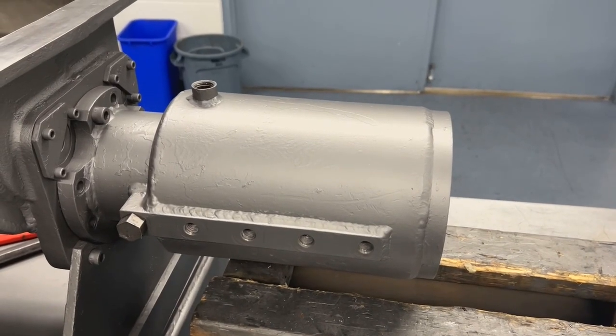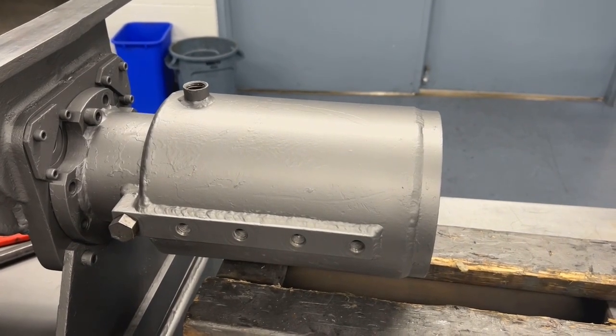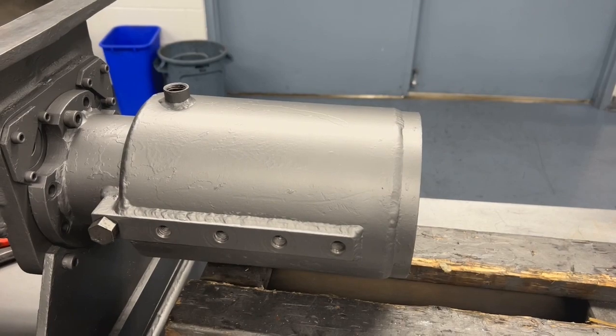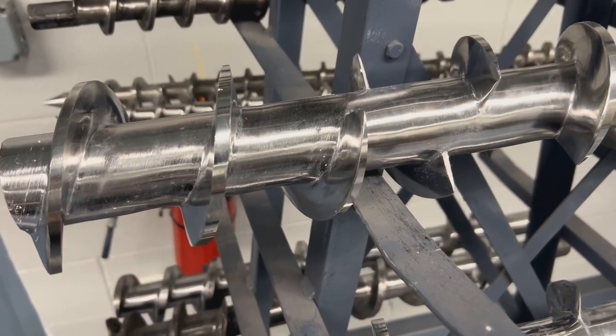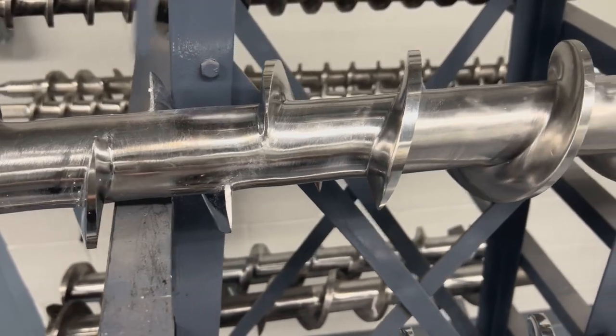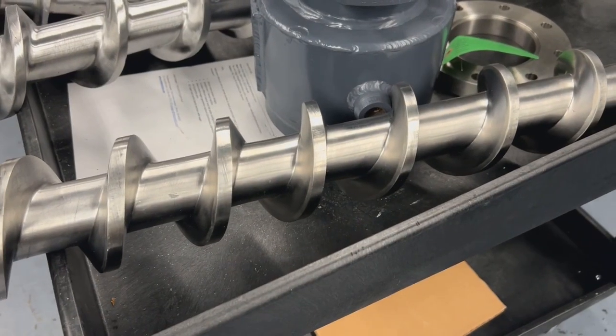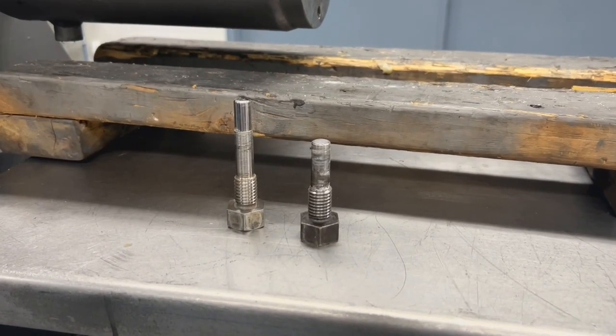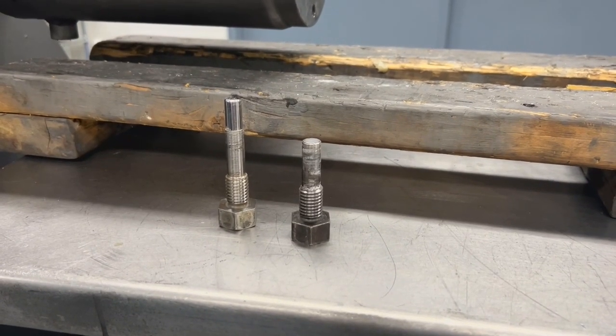Before reinstalling the pins, verify that you are using a slotted auger or a continuous or compression auger. If the auger is slotted, then you can use standard pins or dummy pins. If it is continuous or compression, you will need to use dummy pins in order not to damage any piece of the equipment.